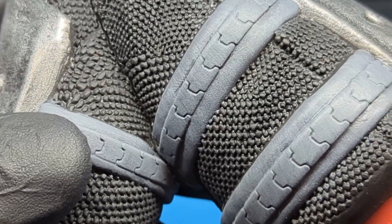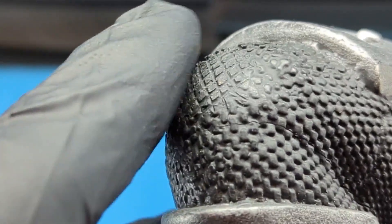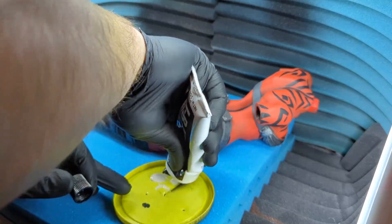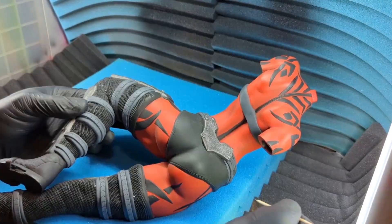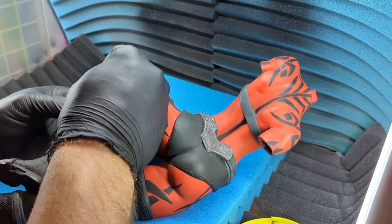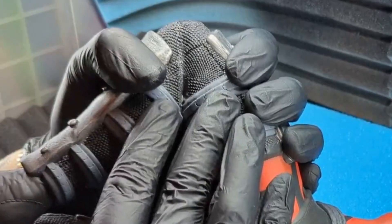Before I go pouring liquid resin into the leg, I do need to take the precaution that some of that liquid might come dripping out through the crack. Even though it's a hairline crack, there's always the chance that something could slip through. So I'm going to take a little bit of epoxy welding glue — this is JB Weld, the same stuff I use in all of my repair videos. I'm going to slightly seal the crack from the outside before we go injecting resin on the inside. It's a two-part epoxy, so I'm taking equal halves from each tube, mixing them together, and lightly dabbing it onto the outside of the hairline crack — not to cover up any of the textures, but just to slightly seal it from anything leaking through.